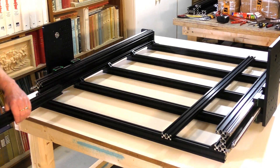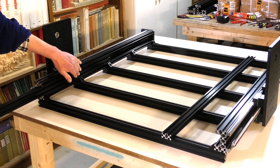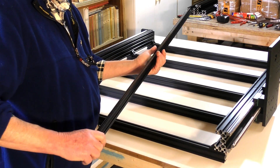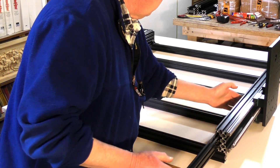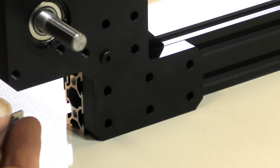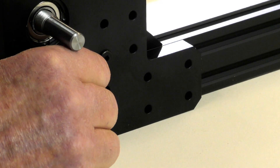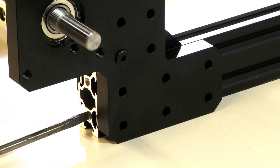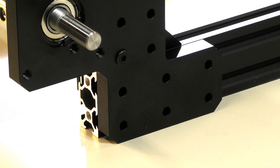At this point, I found it's the best idea to put the stiffeners into the y-axis and just slide them in — they're a very good fit. Now you need to insert six M5 T-nuts: three in the lower and three in the upper. Sighting through the hole, you can get a flat-bladed screwdriver and just push it through until you line the holes up, and you can put a screw straight in.